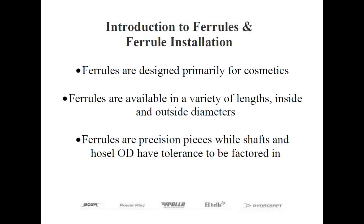For years, the outside diameter of the ferrule was typically made larger than the average hosel. This required that the club maker turn down or sand the ferrule flush with the outside diameter of the hosel to provide that nice, smooth transition. Many club makers find turning ferrules takes up valuable time, or they simply don't have the right equipment to do so. To eliminate the need for sanding, it's useful to have the appropriate sized ferrule. In the case where the ferrule is undersized — where the base of the ferrule is smaller than the outside diameter of the hosel — this shows poor workmanship.